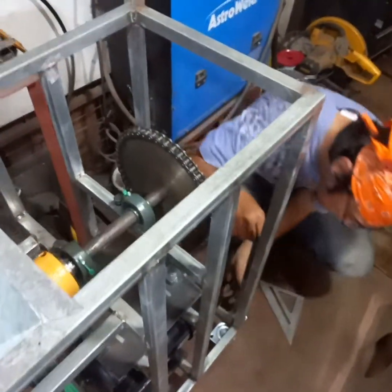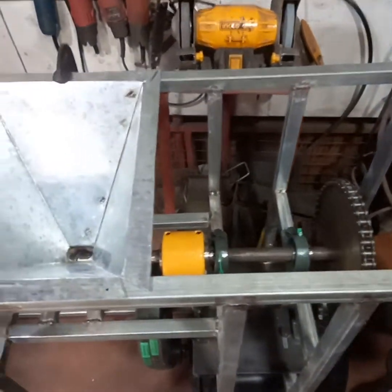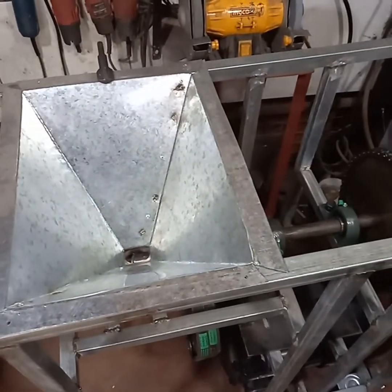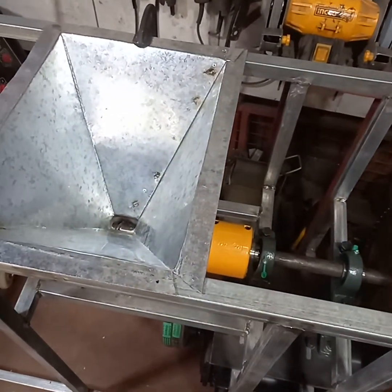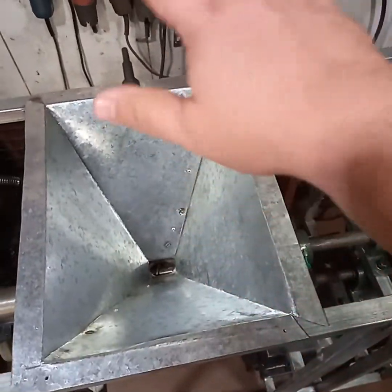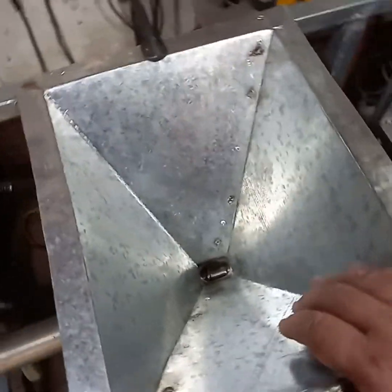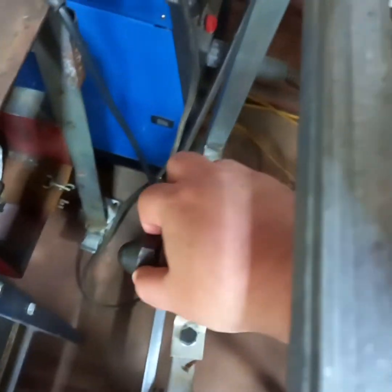This is still the build phase. After we get everything done — the sheet metal finished — everything will be disassembled, painted, and reassembled and ready to go. This is our feed hopper, so plastic comes in here, the screw pushes the plastic where it melts on the heated barrel with the heaters attached, and it comes out the end.